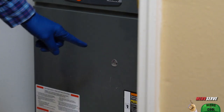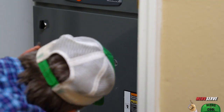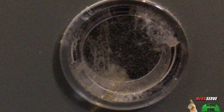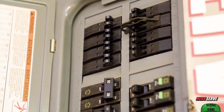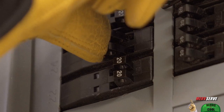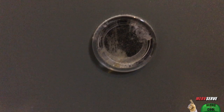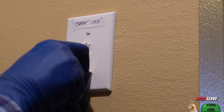I first utilized this peephole. If the unit is on, you'd see a blinking light inside. But that's not the situation here — it's just a dark hole with no obvious energy. There's no power going to the control board. I checked the breaker in the garage; it wasn't tripped, but I reset it for good measure. Still no power to the control board. So I know the power is coming from the breaker box, and next stop would be this shutoff switch.